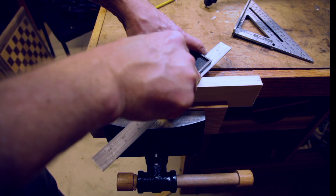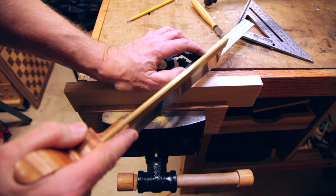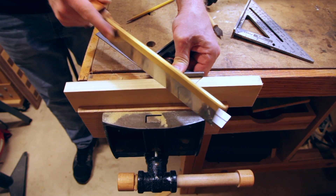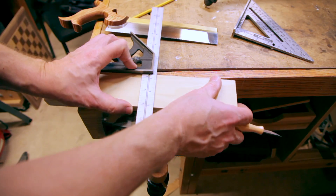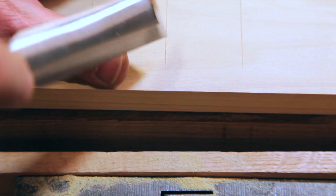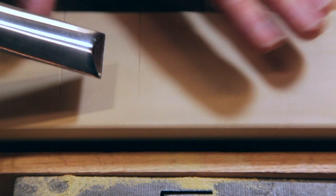I'm using a knife to make a kerf for the saw to follow. I use the combination square as a guide to keep my saw at 45 degrees, and I'm just going to make a starting cut at the top — one in each of those marks. Now take your marking knife or pencil and transfer those lines down the front and back of the back piece. You want to make sure the saw follows these marks. Then I'm using a chisel to widen those to make a kerf for the saw to follow, so when the saw is cutting through the wood, it'll fall into that groove and stay straight.